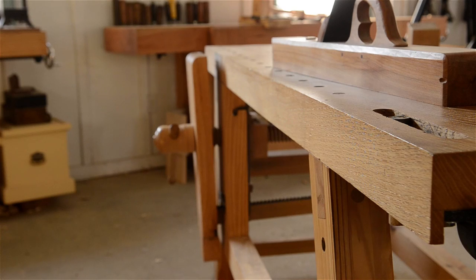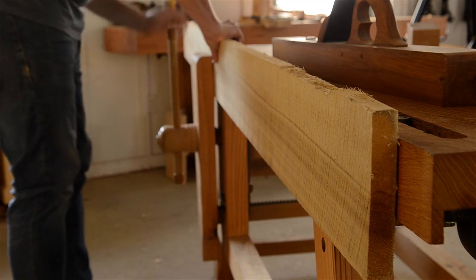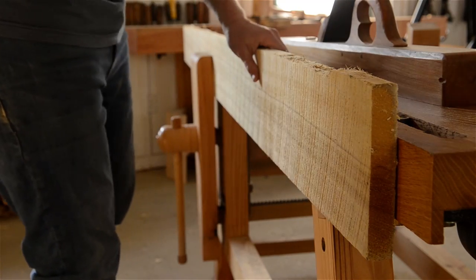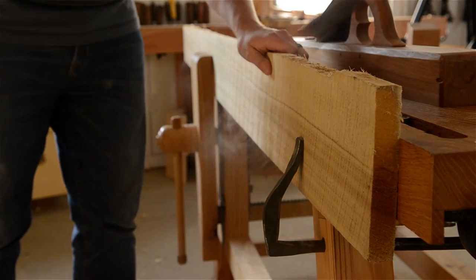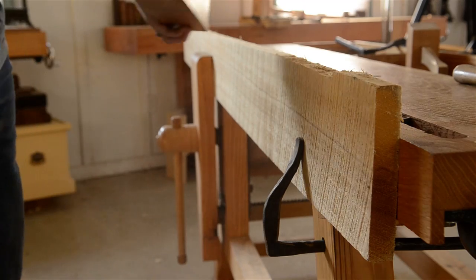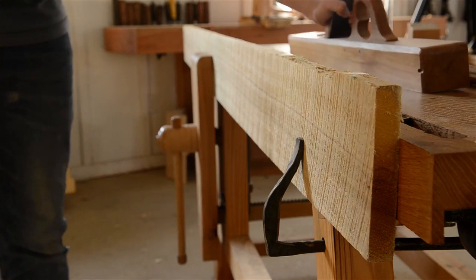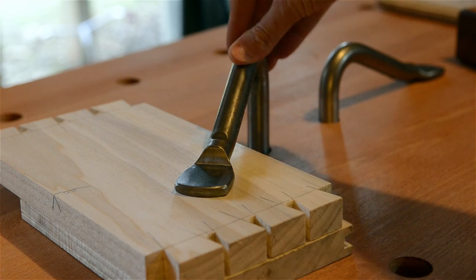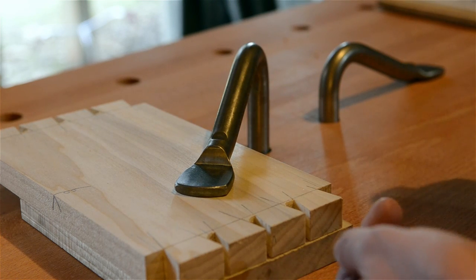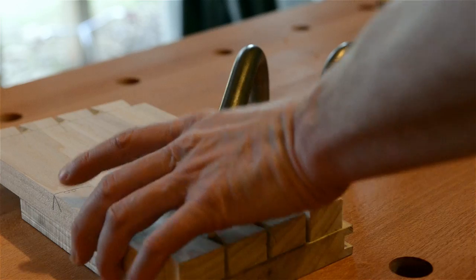A hold fast also allows you to hold a long board up against the leg of your workbench with the other end in your face vise so you can hand plane. In my woodworking school I use two different types of hold fasts. The first type, and my favorite, is a hold fast that's forged by a blacksmith. They seem to flex better and they look really great with the historical workbenches that I have. However, they're usually pretty expensive — around $75 each. Another good option is a much lower-priced hold fast that's made out of formed wire. It doesn't flex quite as well, but it works fine, and with a little work I've been able to get these particular hold fasts to work in every one of my school's workbenches.